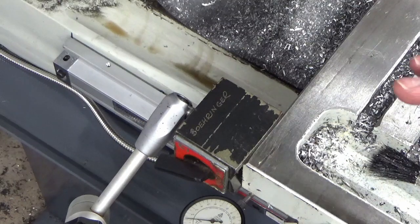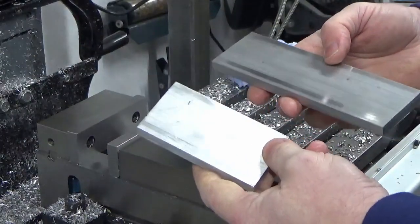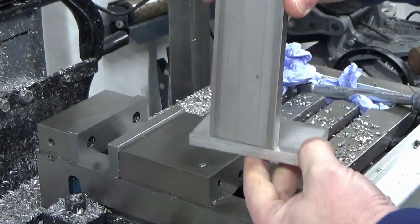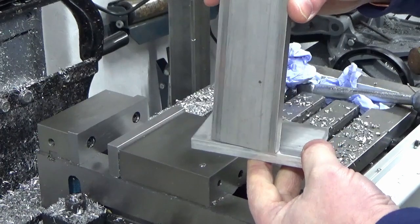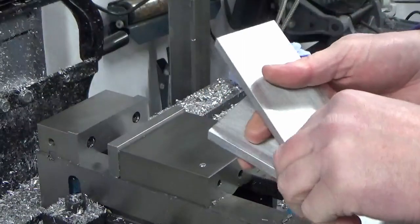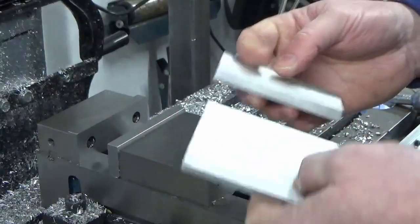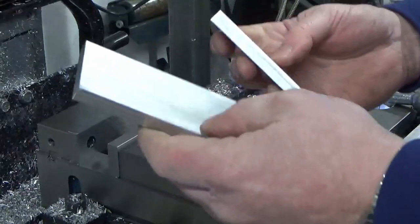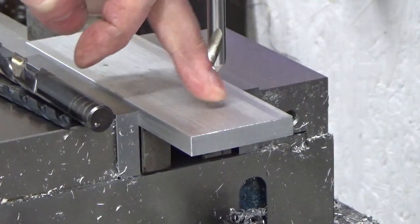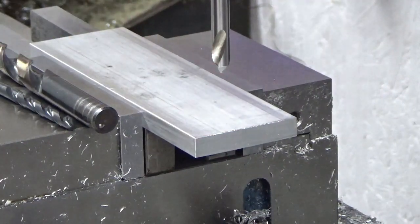The next thing is to work out how we're going to attach the bridge to the reader. I've cut two more bits of aluminium — this bit will fit to the underside of the reader, and this bit is the bridge piece that will go down to that from the spacer I've already fitted. First job: we'll get them in the vise, get them squared up and finished off to length. This one's critical lengthwise — I've taken some dimensions I need to make this to. Then we've got some various patterns of holes to drill in these. I've got a central clearance hole and four drilled and counterbored holes for four cap screws.